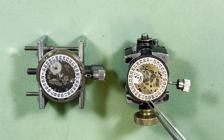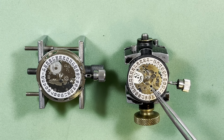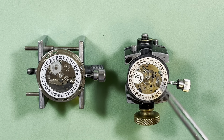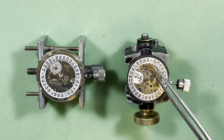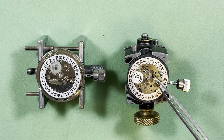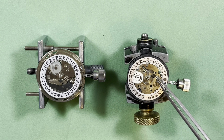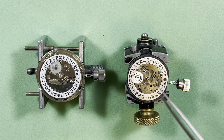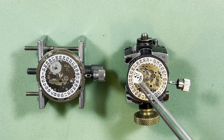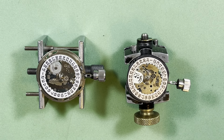Here we start to get into the real differences. You'll notice again more of these really thin plates, really thin stamped metal. The 754, the 7As have this same kind of thing. Held in place with 3 screws, and this is the date corrector wheel situation right in there, the date advance, and it just sits there. This is the date driving wheel, all plastic, single component. It's perfectly fine. Everything is great right up until it isn't.